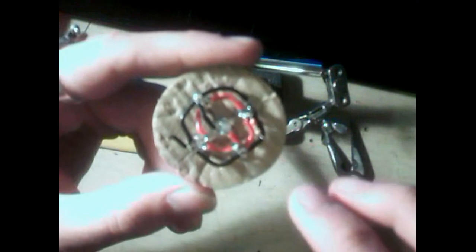We've got your black wire sticking out on the side for ground, and what I'm going to do next is cover this part here entirely in hot glue. That way no short circuits are going to be possible, no matter how much this thing fiddles or moves around. Afterwards I'm going to drill some holes through here, or you can do it with a knife, just be real careful. Wire those in through the back, and then we're going to connect it to the bicycle, and at the very end we'll wire in the switch. I've got this push button switch here, which who knows where I got it, and we'll hook the backlight up too.